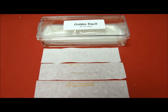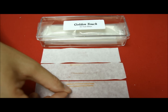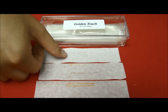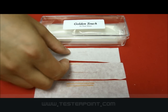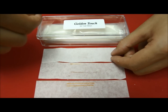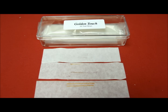We are now going to explain how the testing strips work and how to maintain them. The markings from testing are still sharp right after use, but after a few hours they will start to disappear. So after a couple of hours you can use again the same strip. You can also use the other side of the strip — turn it over, put it back into the tester, and do new tests on the reverse side. Once you have finished using the strips, make sure you always put them back into their sealed plastic and back into the box. As long as the strip is still wet with the specific testing liquid it will still work, but once it dries out the results will not be good and the strip will not be useful anymore.